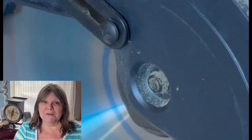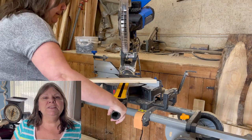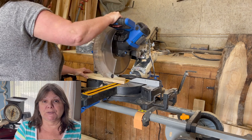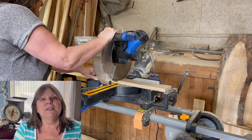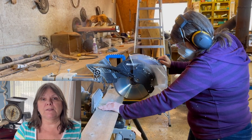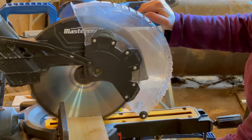Another great one off my crafting bucket list today. I planted a window box — I made the shell of it out of white cedar. I used a 1x6, and it's a true 1x6 because it's not planed down. I cut the long sides 39 inches — the back and the bottom at 39 inches. The end pieces are 5 inches. Just a couple cuts and you're good to go.